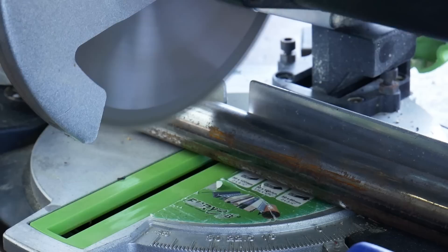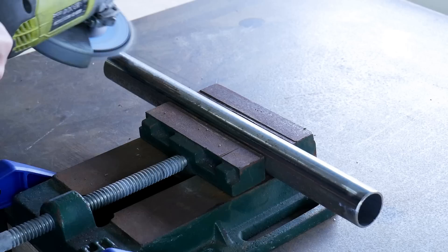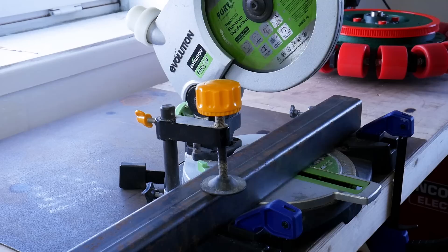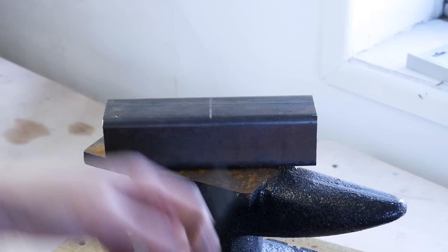I've cut some pieces of 26mm internal diameter tubular steel and I got myself a little mitre saw which seems to cut through that with no problem. I just cleaned all of that up so that it's nice and shiny and we get some nice clean welds, or at least the best that I can do. The next thing to do is cut up some box section steel — not sure if the mitre saw is going to cut this but yep, seems fine, seems to go through like a knife through butter, so that's going to be a really useful tool for the future.